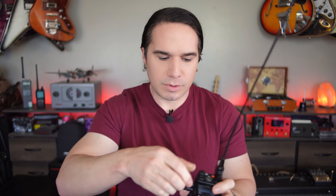The last thing I want to mention about the air band stuff is you can get a super cool set of adapter cables that plugs right in here — it's an adapter cable for the general aviation dual-plug setup for an aviation headset. So you can put your headset on and listen, maybe if you're a student pilot and you want to practice responding to your radio calls. Now keep in mind, the air band is reception only — you cannot transmit on the air band through this radio. There are handheld radios where you can do that, but they're aircraft-specific and much more expensive radios.